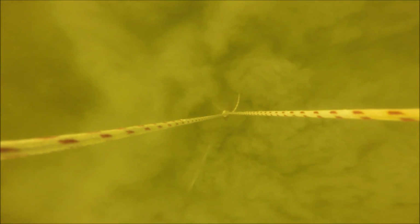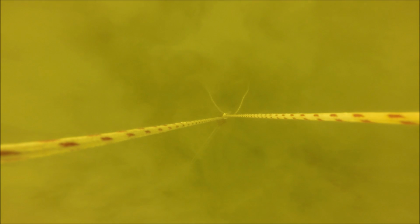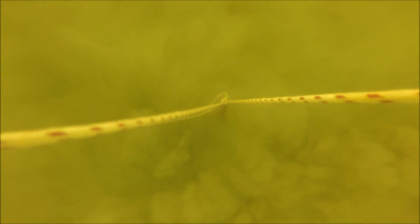Here it is at the first reset, the boat passing by at 3.5 knots, the anchor releases and resets within, say, 3 anchor lengths. Boat stopped real quickly, and then it turned it around and held the boat again at 3,000 RPM. Okay, the boat's now passing by for the second reset, anchor releases. Now for these I've held the boat speed high. It's certainly more than 2 knots, but it's maybe a little less than the 3.5 from the initial reset. I'll just let this roll.